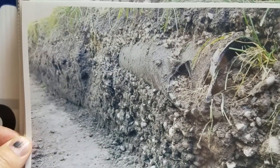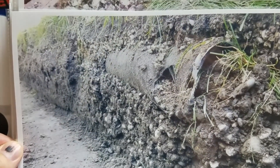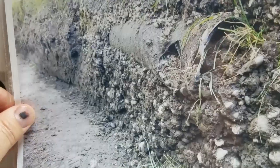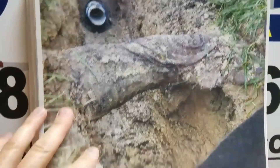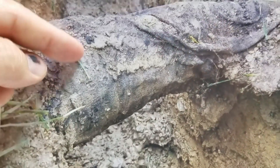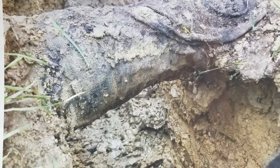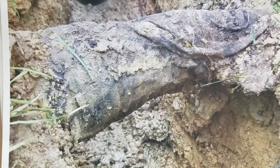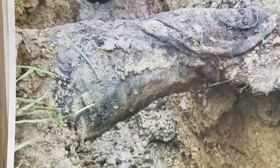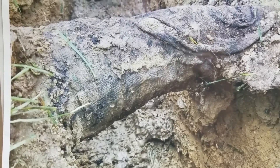The pipe itself wasn't plugged — you can see some dirt pushed in it from the backhoe or excavator — but you just couldn't get water to the pipe. That's the problem; it's because of how they installed it. Here's another we see a lot: a corrugated drain pipe wrapped with drainage fabric. You don't want to do this either. These systems only work if you can get the water to the pipe, and the way we build them with so much stone, the water will move through the gravel.